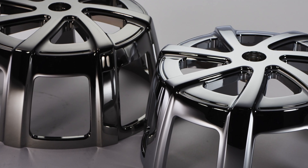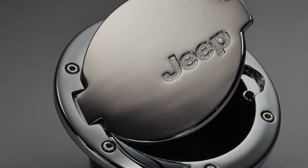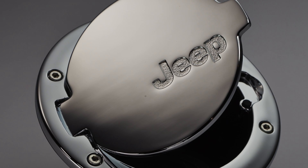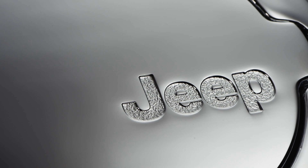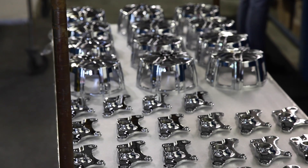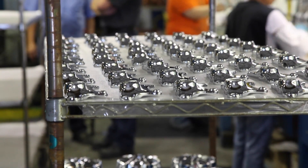Black chrome has been around for about 60 years, however its popularity has just taken off. Black chrome has a unique look compared to the mirror appearance of our standard chrome plating. The desired appearance can be from shiny to flat depending on the last layer of plating that is applied prior to the black chrome layer. We can achieve whatever gloss level our customer may request.